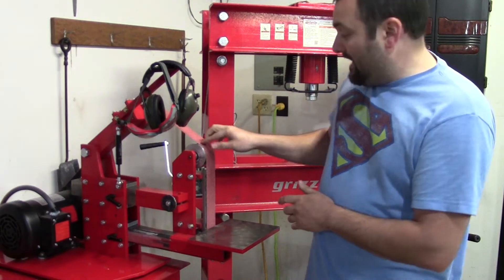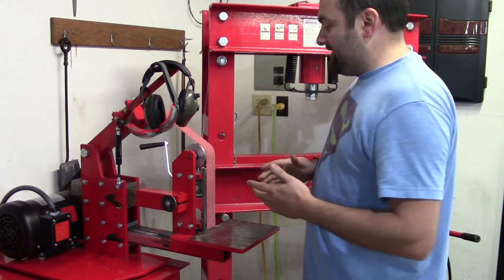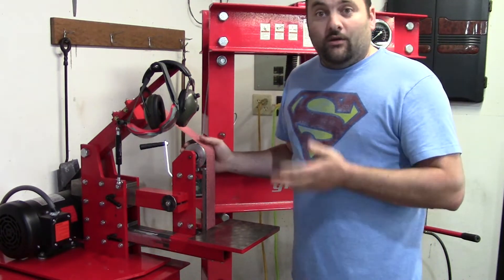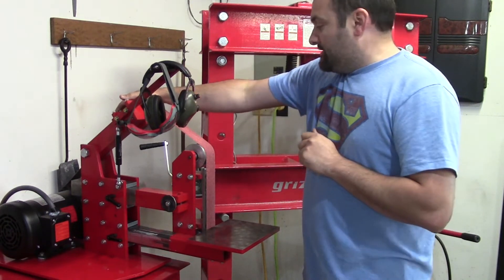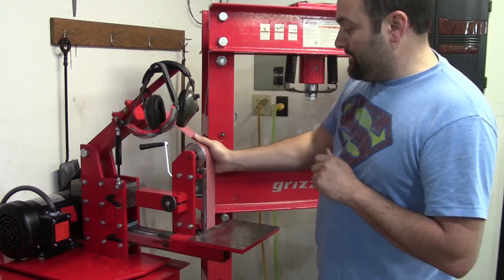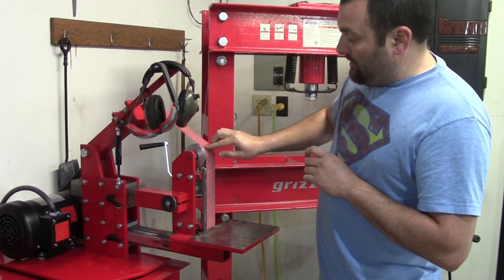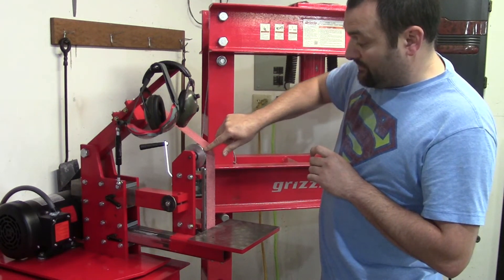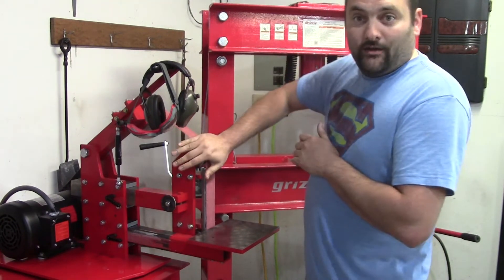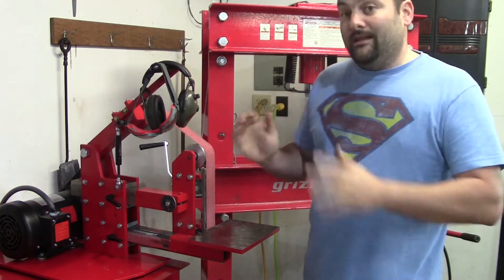I don't even have crowned wheels — every single wheel, whether idler or drive, is flat. You don't need crowned wheels unless you're compensating for bad assembly or machining practices. If you make everything straight, you don't need coned wheels, especially on a tracking wheel. I also have more than one set of holes because a lot of wheels you buy are two-inch. I went with three-inch wheels because I don't want to be roasting the bearings constantly — a larger wheel lets the belt surface move faster while the RPMs go slower, so your bearings will last a lot longer.